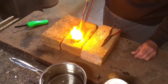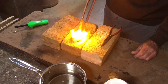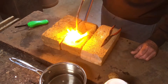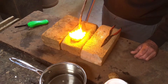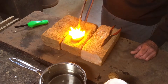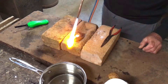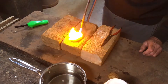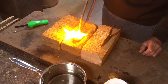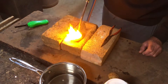The gold is just about molten, but I want to let it shape nicely into a nugget — just to pick up all the little pieces around the edge. Give it a little bit of a shake. That's a nice looking little button there. Just a little bit more heat to make sure I've got everything. I can see the liquid borax floating around the top. I'll take that heat off.